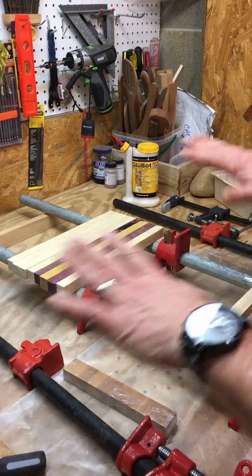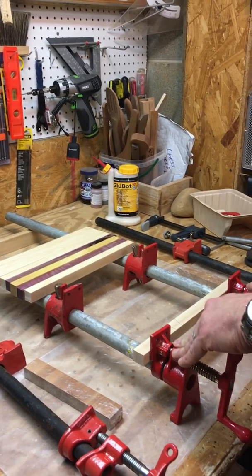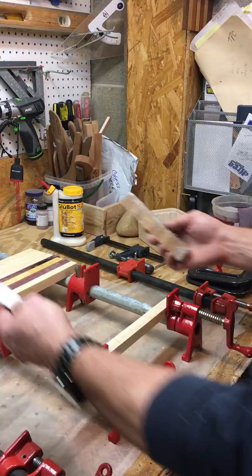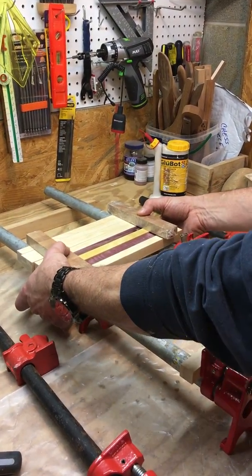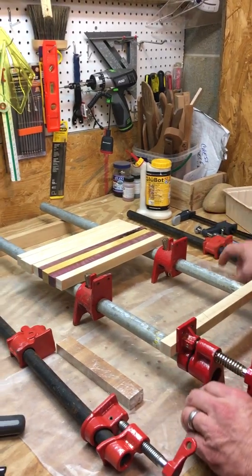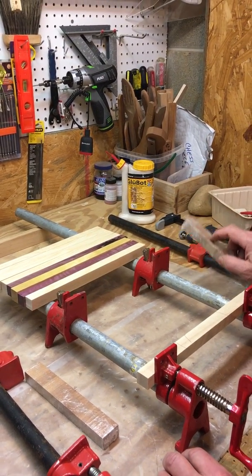The first thing is having a clean work area, and then having all your supplies here. These pipe clamps I think work the best. I've got some extra clamps that I'll be putting across the middle of the board. I've got a couple of blocks of wood that I'll end up using to place over the boards, and then clamp these down onto the pipes, which help keep the boards flat as we go. These are wrapped, by the way, in saran wrap, which will keep them from sticking to your cutting board, which you definitely don't want to happen.